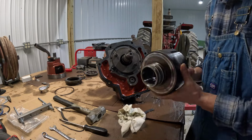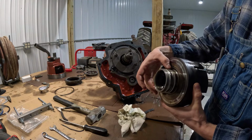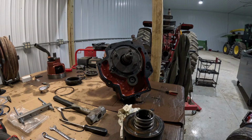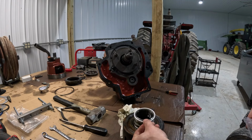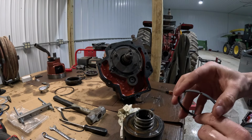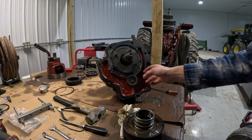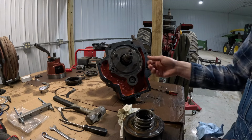Yeah, these Teflon seals here, I was told can cause some issues with the problem we're having, which got pretty hot. The kit that I got here from that other 1066 I rebuilt. So this is the Teflon ring that they give you, but this kit gives you metal ones. They lock in like so, and they're a lot stronger because it's steel, but we'll put them on these. That came with a heavy duty clutch that I put in that other tractor.